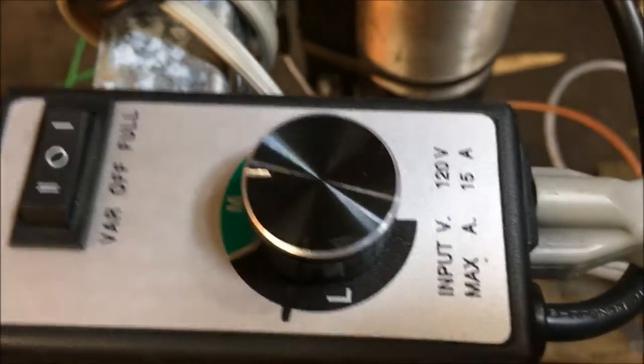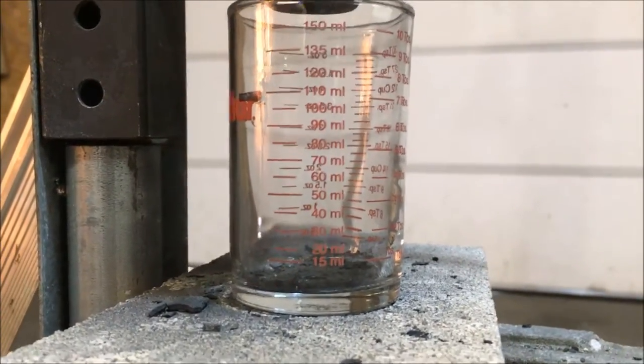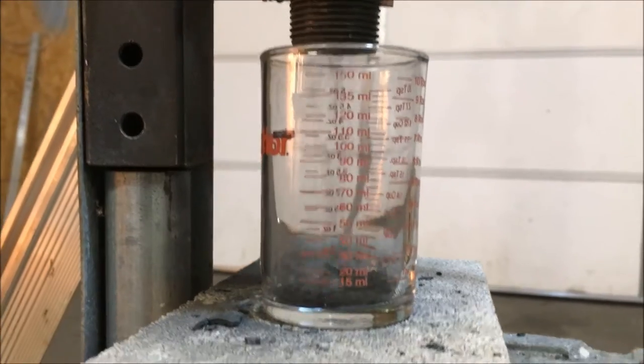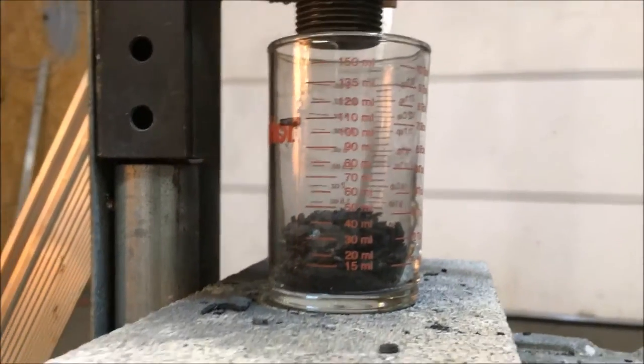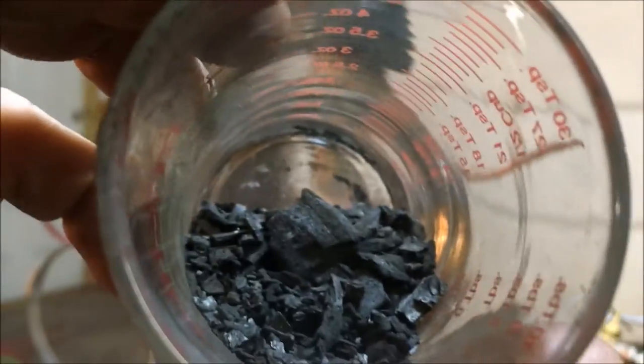In this video I'm going to be testing the triac at the midpoint because I'm concerned about the behavior of triacs at low power settings — something else triggering on the system could shut my triac down on me. I'm not sure why they do that, so I need to get a little bit more flow data on the output of this auger. That was about a 30 milliliter shot — I'm thinking that's about how much fuel I'll be shooting in there each time; anything more than that would reduce fuel production by inhibiting air flow.